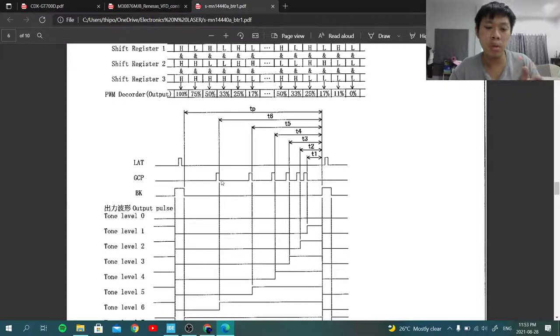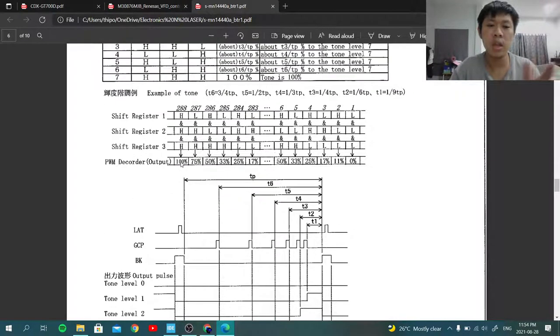And the big problem is, if I don't use DMA, the normal way to send SPI data is to use the CPU, and that is a blocking method. The non-blocking method is to use DMA. And just guess how long it will take from running that command, after all the parameters are done and DMA starts, to go to the next cycle. It would be longer than 20 microseconds, because the way I calculated 20 microseconds was to use the clock frequency to find how long a single bit takes, and then multiply by 288 to get the total time.